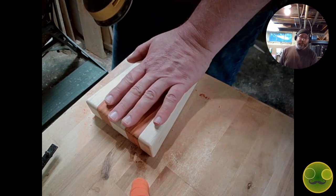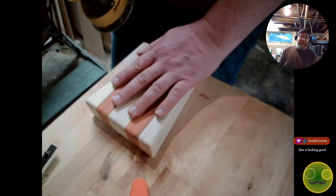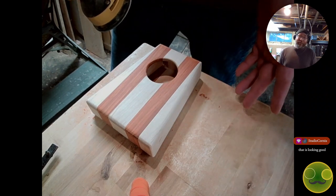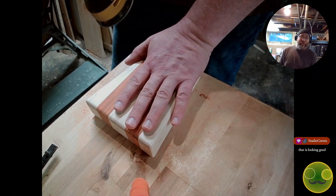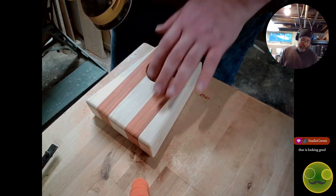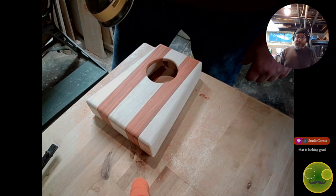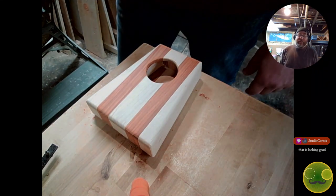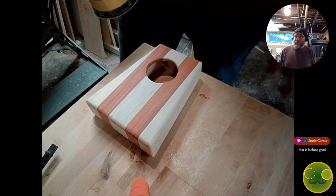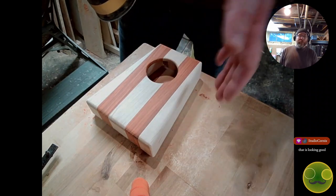So we're just going to bring this down a little bit so that the grain, so you can't feel it. For you guys, it won't look like I'm doing anything, because you can't really see any difference when I sand it down, although maybe the wood will look a little bit lighter. And then I'm going to run over it again with, so this is 220, and I've got some 320, which is basically the final sanding coating. And then we'll do one coat of the oil.